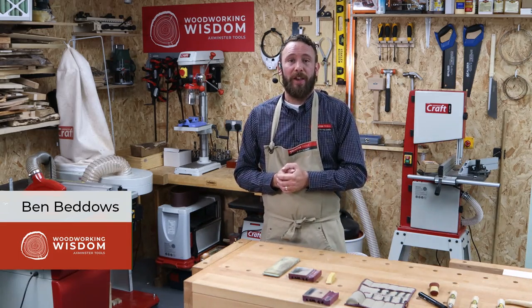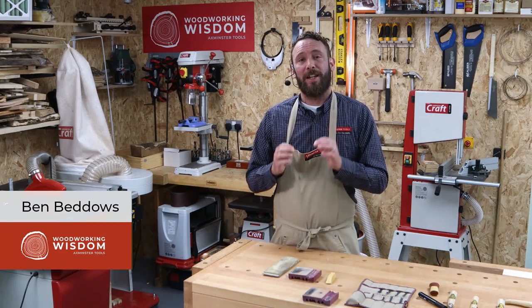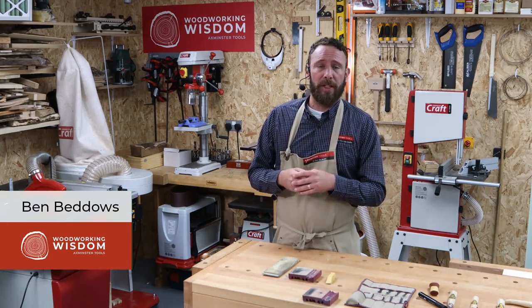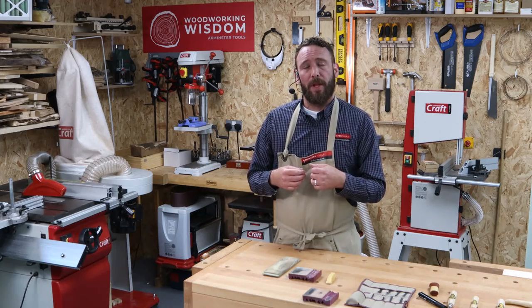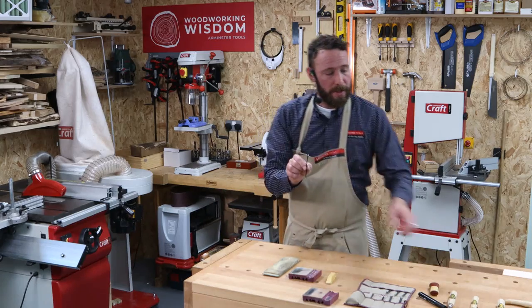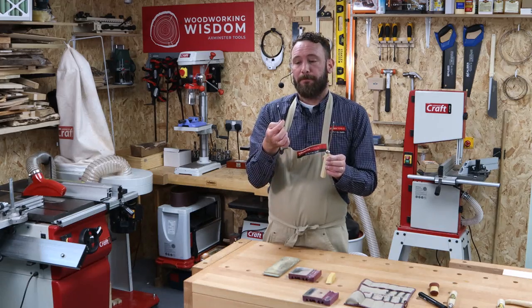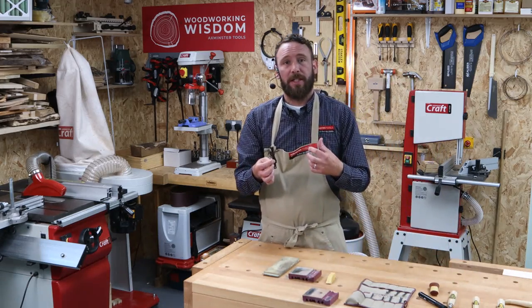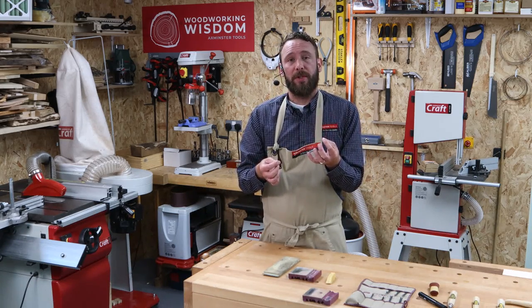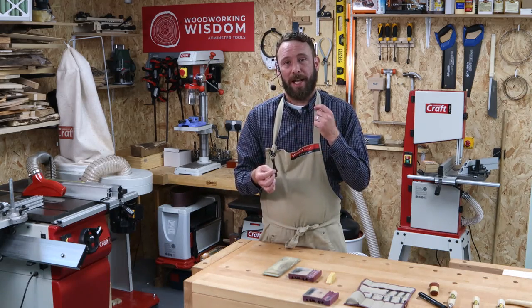Today we're concentrating on stropping, or using a leather strop to keep these tools in tip-top condition. That's really what I would recommend, especially if you're using tools with thin steels, like with FLEXCUT, where they have smaller steels than your carving chisels. You don't want to introduce too much heat in these through grinding, and because there's so little material, you quite quickly reshape the tool. So we're looking at honing and maintaining today.